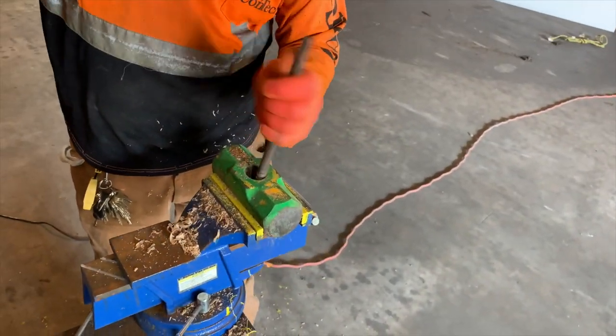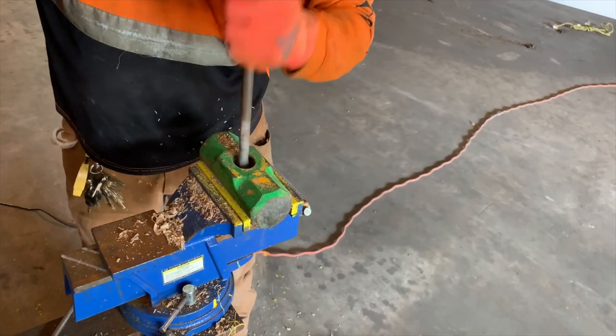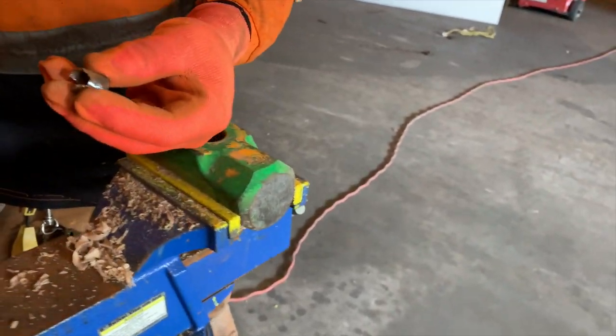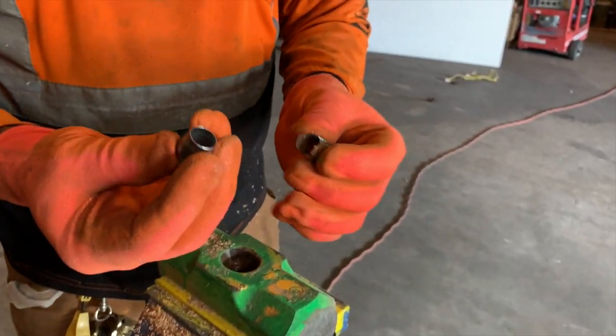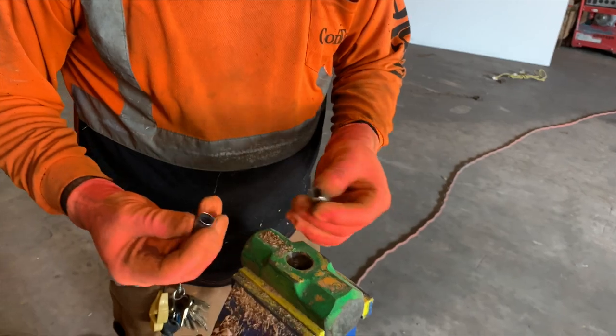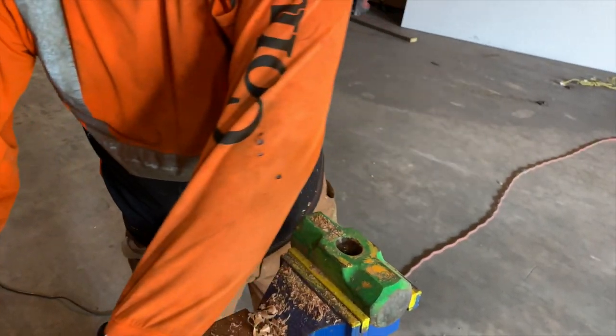You want to totally clean out the inside of that hammerhead before you install the handle. You'll notice the wedge that came out is the original round wedge — you can purchase these from places like Amazon or your local hardware store.